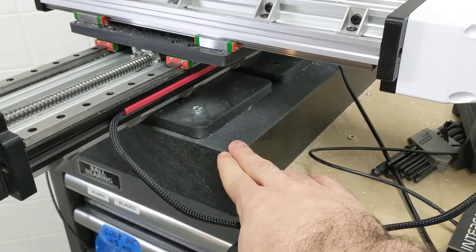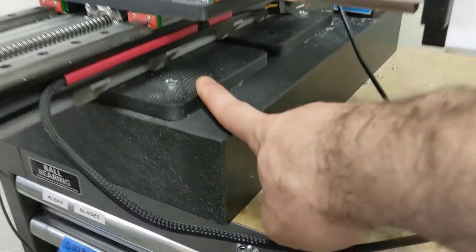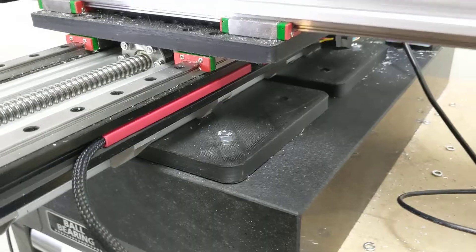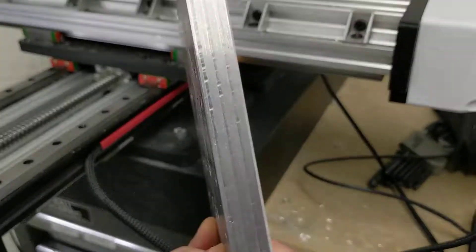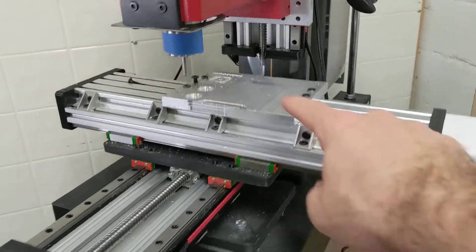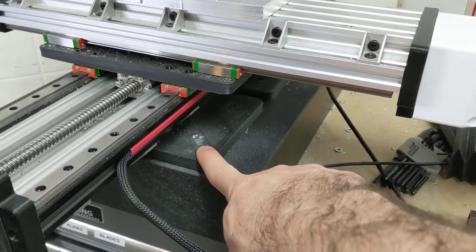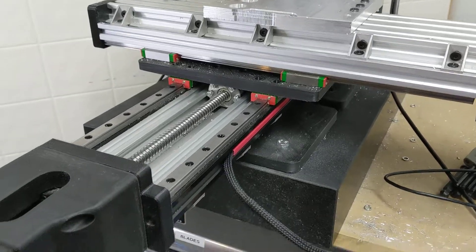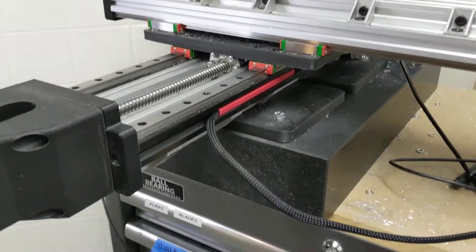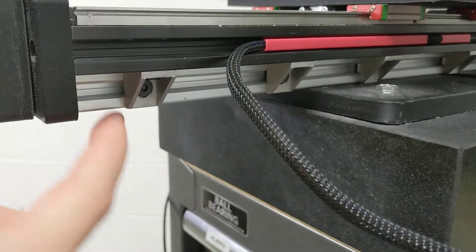Going from the granite, mechanically coupling the components rigidly is the name of the game. I have a custom 3D printed plate — not optimal, but I was testing the design philosophy of 3D printed components. I do plan on swapping that out for aluminum plates, which are direct replacements. The aluminum plates have actually already been made on this mill. I've been taking test cuts and understanding what the mill is capable of. The linear actuators are designed using OpenBuilds aluminum: there's C-beam in the middle, 20x20 standard extrusions on the side, held together with 90-degree brackets.